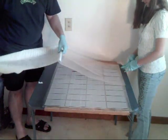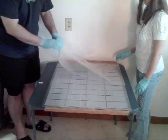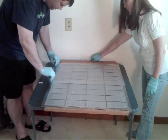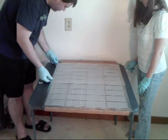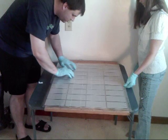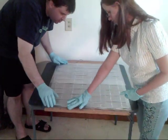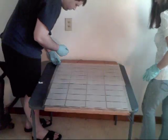You want about a half inch to an inch underneath the edge of the glass, and you can always cut off the excess later. The laminate is just another layer that can be blocking sunlight and you don't want to block any light to your cells. But if you have good enough margins around the edges, it will probably be covered up by the framing. I left a little bit hanging over at the top and that is fine — it will help you get it nice and even so that you cover everything. Then just go back through with a utility knife, or in my case a really dull exacto knife, and just trim off the extra.